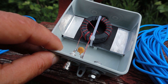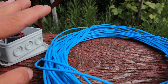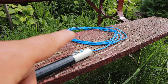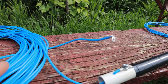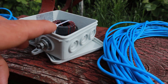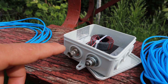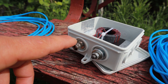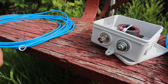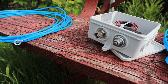For even better results, especially for this type of antenna, the signal path goes like this: you have the very end of the wire, the coil, the long part of the antenna, then the 49-to-1 impedance transformer together with the counterpoise. From there the signal will go to an RF choke, and then from the RF choke I'll have another coaxial cable running down through the attic into my room.